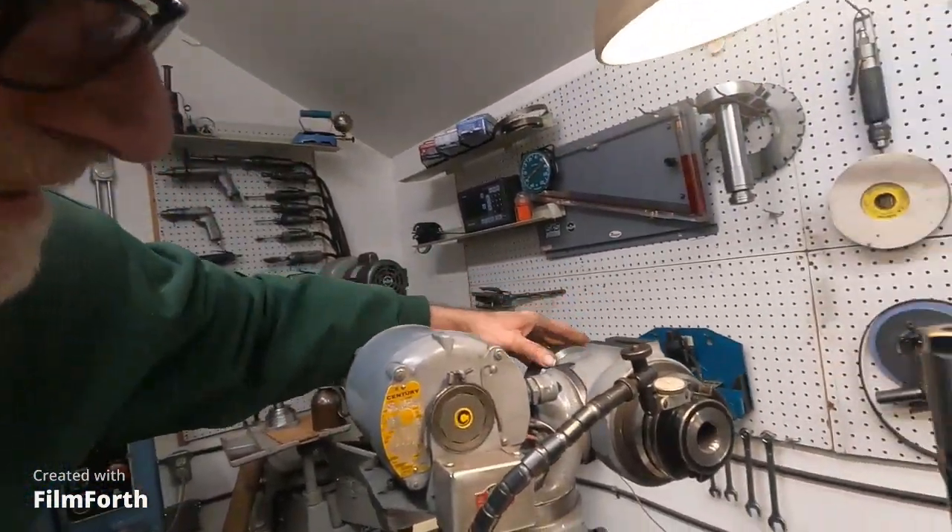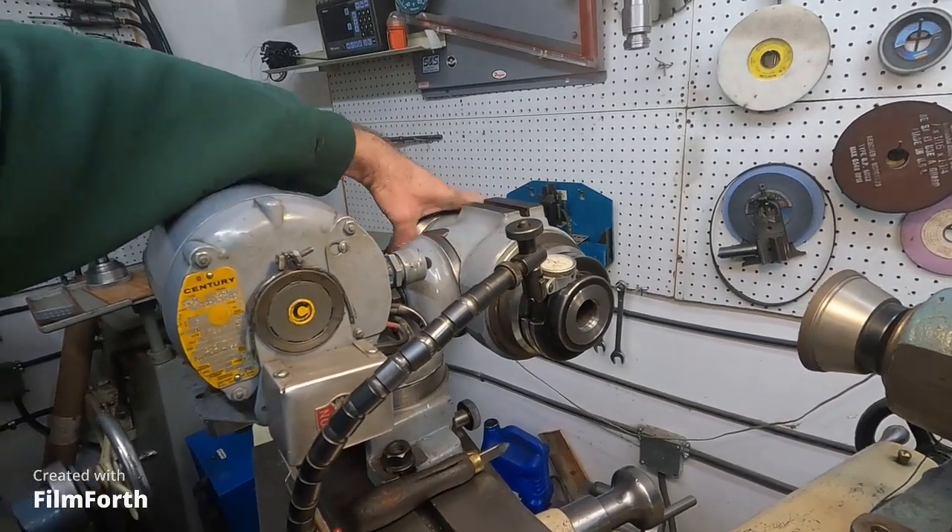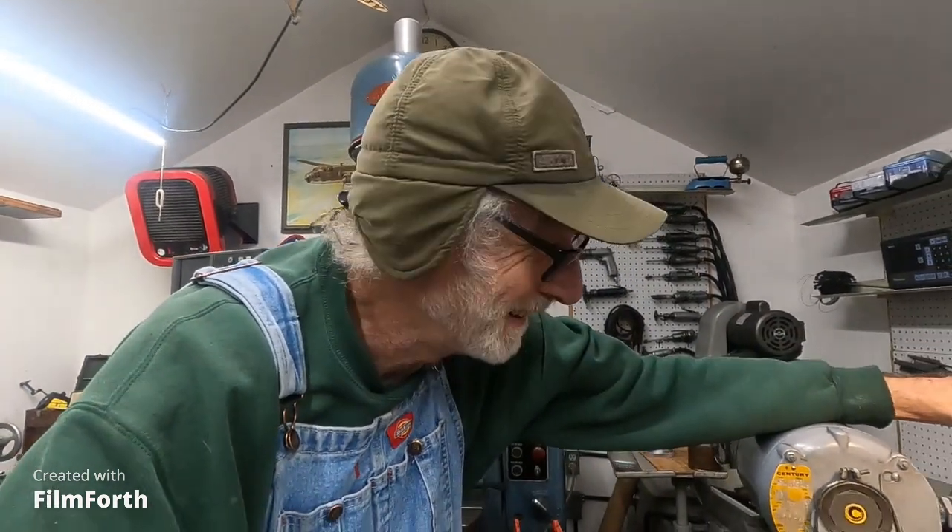With just a little heavy-duty deburring and scraping, I got the tool holders running in within a tenth or two, so I didn't have to grind that after all — and that's great. Getting a horizontal mill and other machinery has thrown a monkey wrench in the works: now I've got to sharpen tools, fix this, fix that. But that's the way it goes. I hope your endeavors are going well — mine are cruising right along. I'll be back with more stuff. Stay busy, bye!